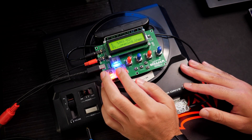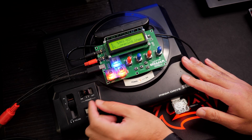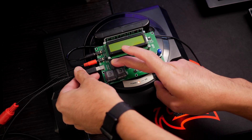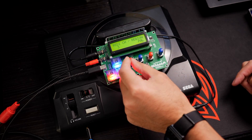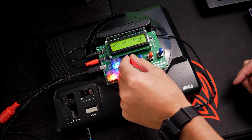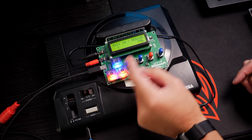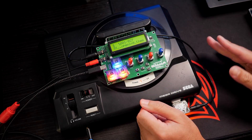New to the new firmware, if you want to change the MIDI channel or the region of GenMDM, it's pretty straightforward. Just unplug GenMDM, hold down the select edit button, boot it up, and it'll take you to the boot menu where you can pick a MIDI channel. You can pick your region as well — NTSC or PAL. Then just push any one of these buttons and it'll save the settings to the EEPROM.